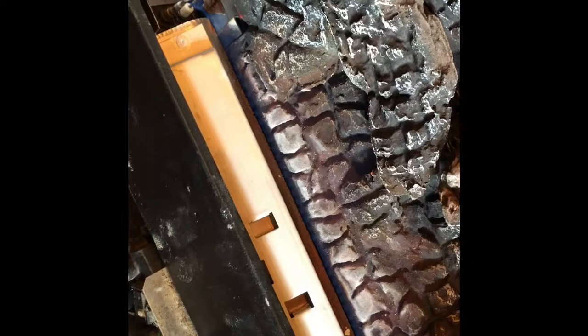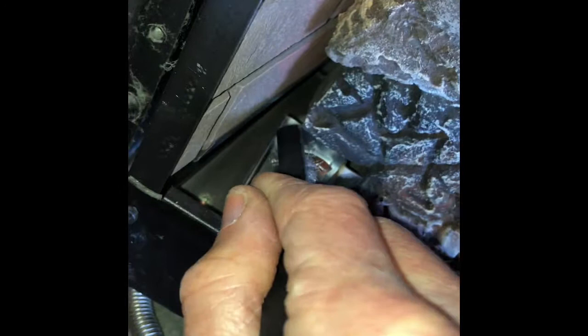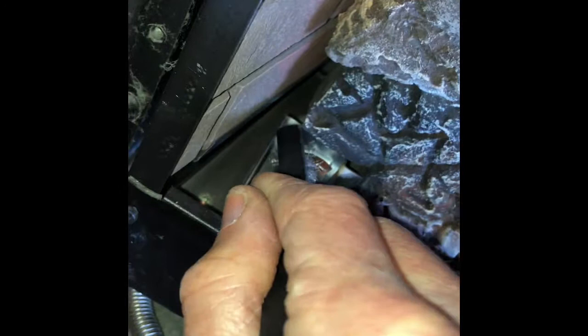This may get you some heat when you don't have electricity or when your electronic ignition isn't working. While you have it open, it's good to take a wire brush and clean the burner assembly, the thermal coupler, and the spark igniter — they get a little buildup over time, and cleaning them can help once you're going to be using the electronic ignition again. These are really nice fireplaces.